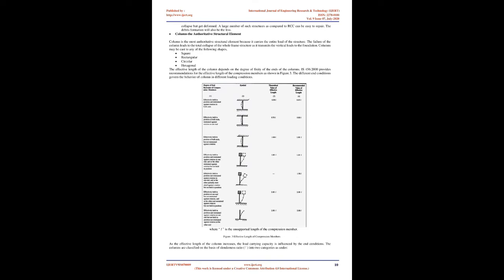Wire mesh. Ferrocement uses layers of continuous/small diameter steel wire/welded mesh, metallic or non-metallic, as reinforcement with high volume fraction, 2 to 8%, and the specific surface of reinforcement is considerably higher for ferrocement than for RCC. Also, the reinforcing steel wire mesh has openings large enough for adequate bonding.